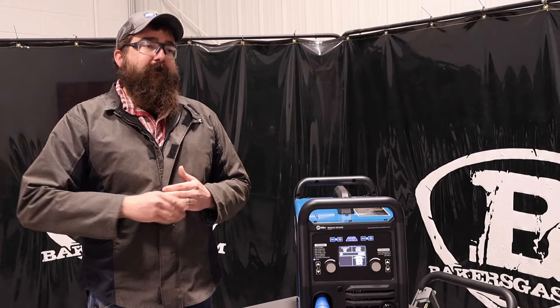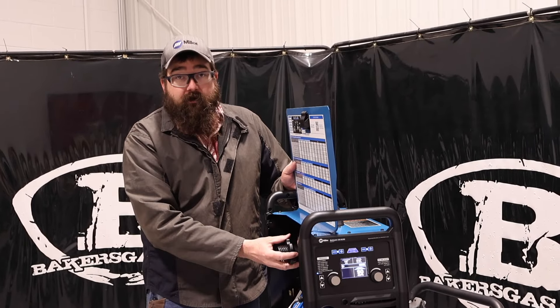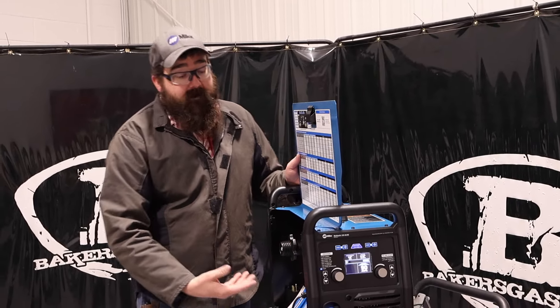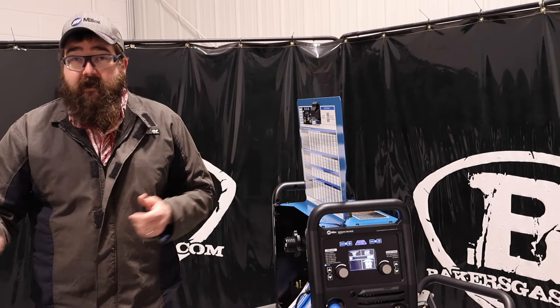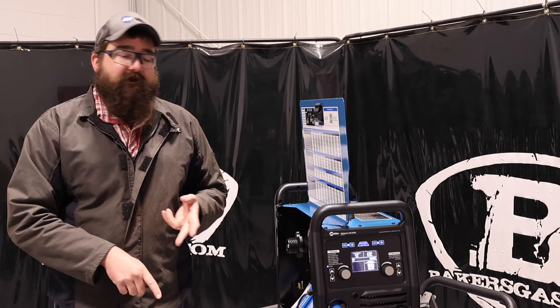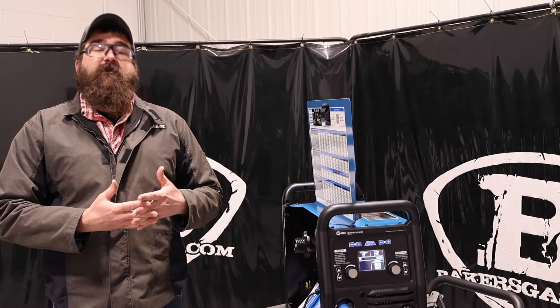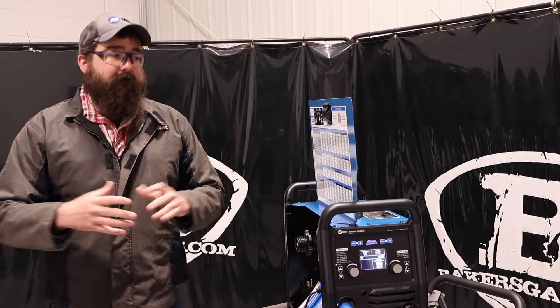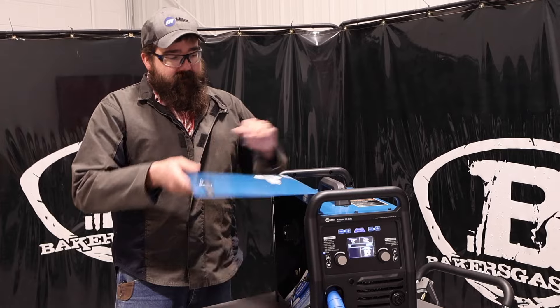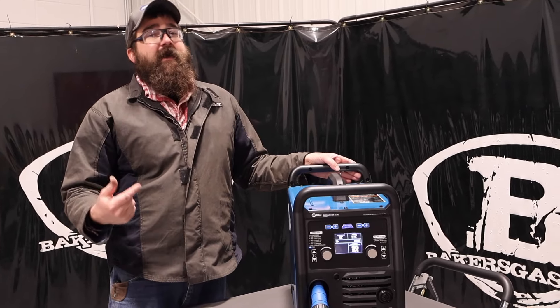These are very popular with home hobbyists, and then we started seeing them take hold in schools, because they're easy to set up, hold a decent-sized spool of wire, you can MIG weld, and when training students how to weld you can flip-flop to TIG AC, TIG DC, and then stick welding all on the same day with the same machine — and you don't spend thousands of dollars on multiple machines. That was the big push for 6010 on this unit too, for the training aspect in schools.